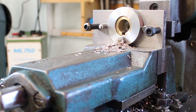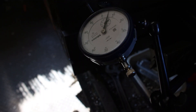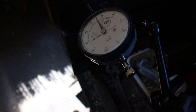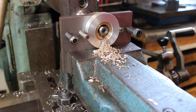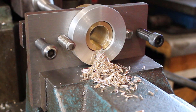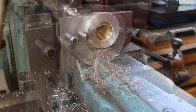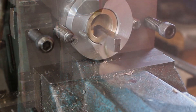There we are. So we move it five thou the other way — so back to zero, another five thou. Okay, I've got two slip gauges here that make up five millimetre, so 197 thou — oh, they have a perfect fit.